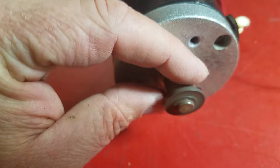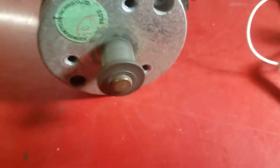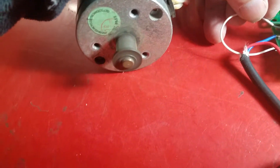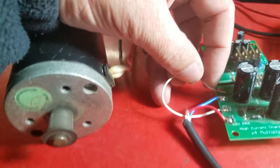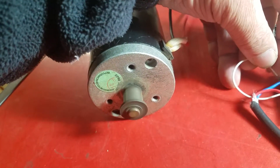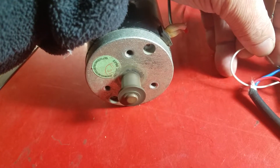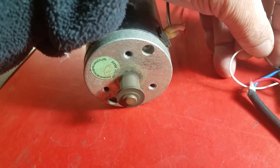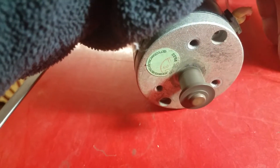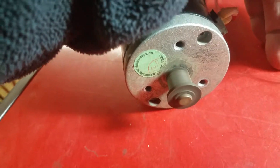That's going to this — it's basically just a standard scooter motor. Its bearings are shot, so it's making a lot of noise. But if I go over here, there's an enable line — it's active low. I just take that to the low end, and you can see it's dramatically different. This is basically a voltage tripler, so it's taking the 12 volts and making 36 out of it. It's rated as a 24 volt motor, but it's kind of history anyway — it's on its last leg.